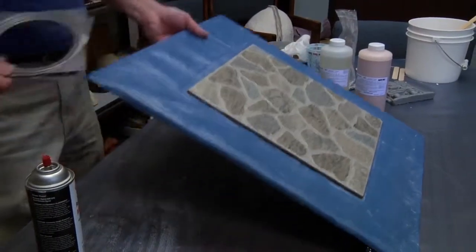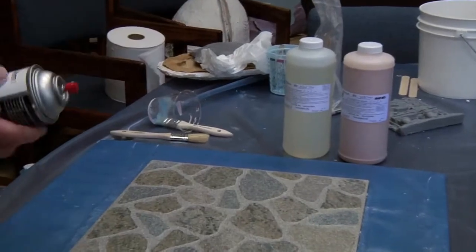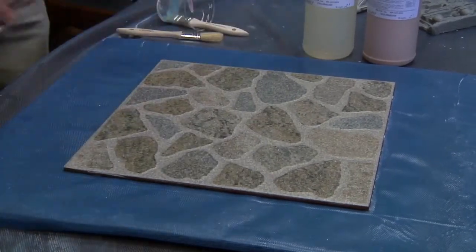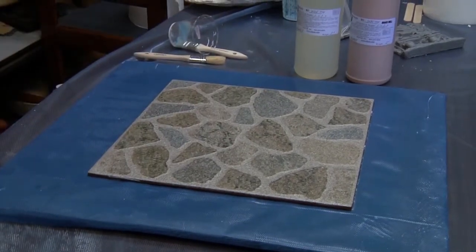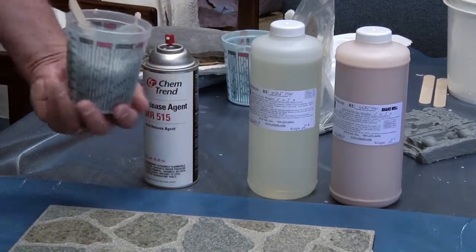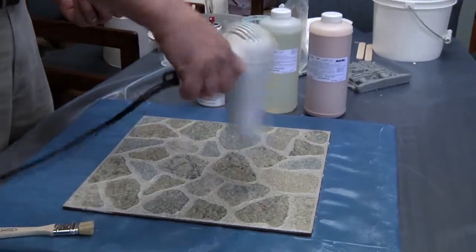We will mount it on a plate. I am using a Lazy Susan turntable on this larger piece so I can turn it around. The mold release is MR515 silicone spray, since urethanes want to stick to all surfaces. I will blow off a little bit of the solvent that may be left over from the mold release.